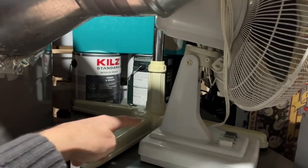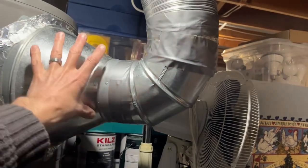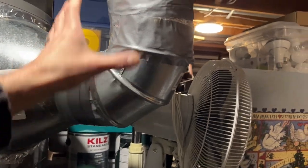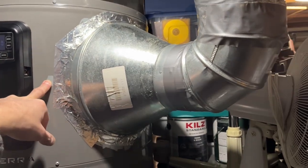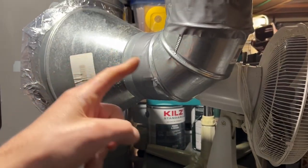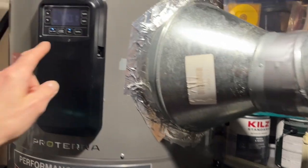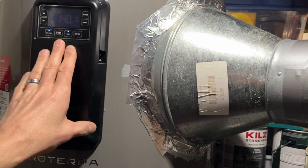I ended up using an infrared heater sitting on the filing cabinet, having it hit against the piping to warm it up enough to get the coil and system warmed up. Eventually it warmed up — took about a day. A previous time I peeled everything off, unscrewed it, and ran a hair dryer blowing hot air into the compressor to warm up the interior sensor that was saying 'don't turn on, you're frozen.' Rheem still doesn't give you good access to what's going on in your system.